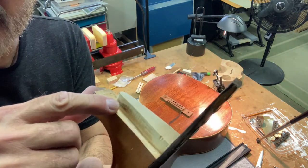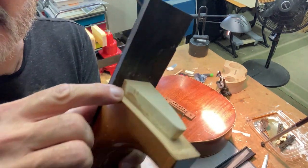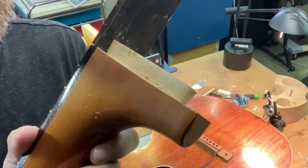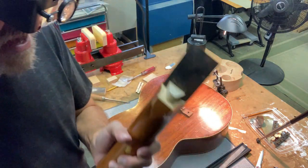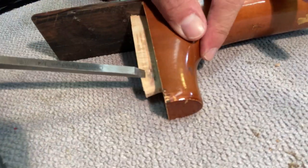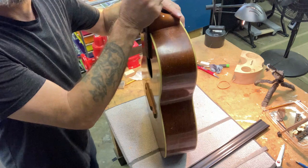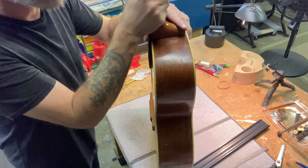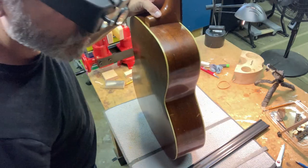Okay, so I can see it's rubbing here, and on this side it's a little bit over here. I don't know if you can see that — I can see just a little carbon impression. Let me clean up some of that. Now it does seem like I have play going both ways on this dovetail, so I should be able to adjust this by doing some more sandpaper swipes on one side. I'm going to do one more and then check it.